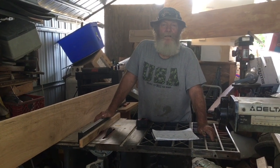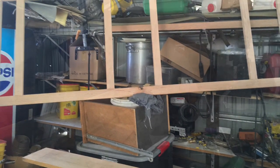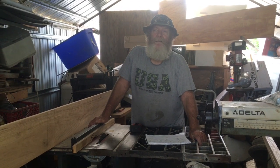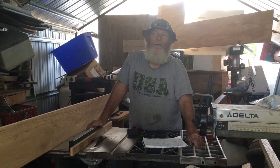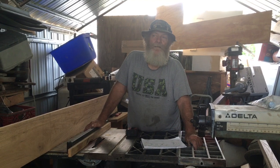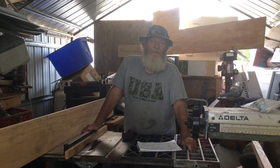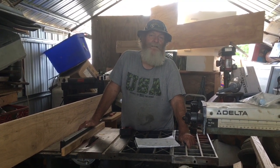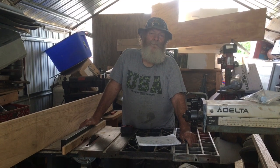We're back up making a face frame — our other one turned out real nice. The stove we ordered was 22 inches, but they don't make it anymore, so it's a 20 inch stove. We ended up with a 32 inch sink instead of a 36, so that threw everything off. We're remaking the face frame to fit what we got. By making the face frame last, we gained six extra inches by scooting the sink over.